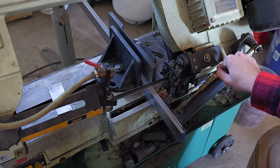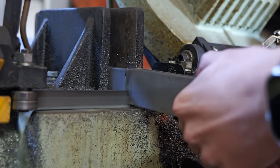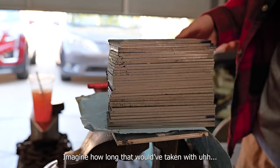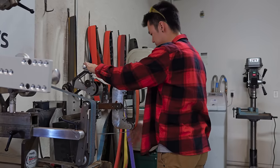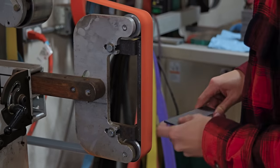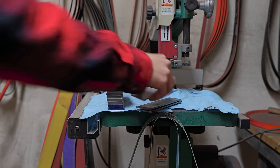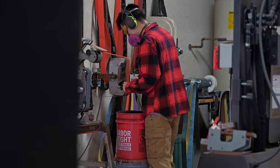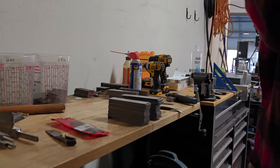I'm starting off a little bit different than all my other Damascus patterns — I'm cutting my bars into six inch pieces rather than four inch pieces. One of the reasons I wanted to start off with more steel is because mosaic Damascus generally requires many more forge welds than other kinds of Damascus. For this pattern I think I'm gonna have to do five to six separate forge welds.